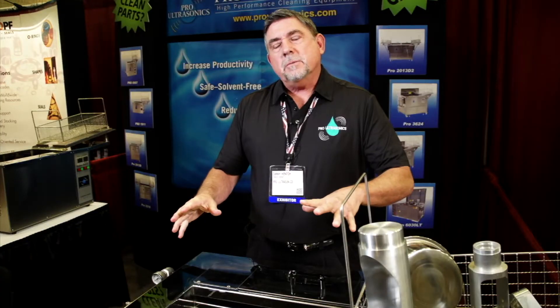What's the life of these units? Do these things wear out? This is a 20 to 25 year product. We look at the ROI — most times it's six months to a year return on investment. Are they made in America? We bring the best parts from around the world together in North Carolina. It's all stainless steel using the best components we can find. We've been doing it for 20 years. The first units we sold are still out there working every single day. What's nice about our equipment is we include filtration and oil skimming built into all of our larger pieces to extend the life of that solution. When we need to dispose of it eventually, it's water — dirty water. We have so many different options to deal with dirty water now that are environmentally sound and safe.